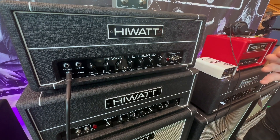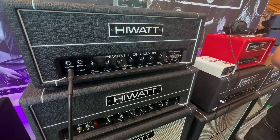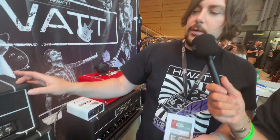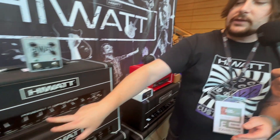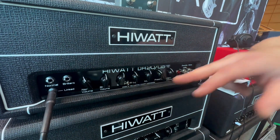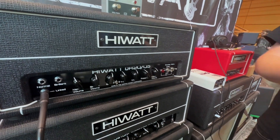This has the exact same preamp circuit as a DR103 and DR504, with a couple of new alterations. Instead of running on EL34s, this is an EL84-based amp. What you'd think with that is that you would lose that sort of headroom, but it's possible to adjust the preamp circuit with our new modification. This is the bass switch and the treble, also known as the fat switch and the twinkle. When the bass switch is engaged, it's almost like you can feel the extra power from the EL34s — it's a new sound for an EL84 that you've not heard before. It's punchy, it's unique, but yet it's the Hiwatt sound that everyone's come to love.